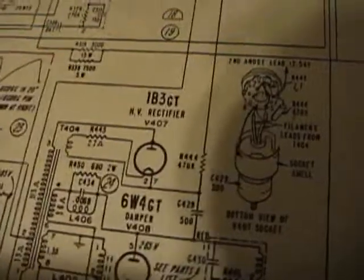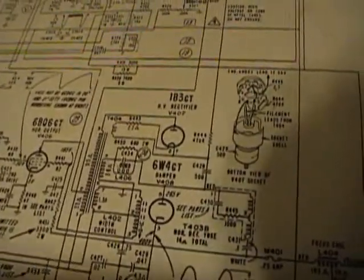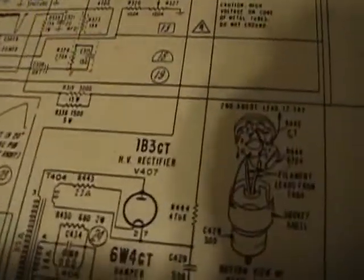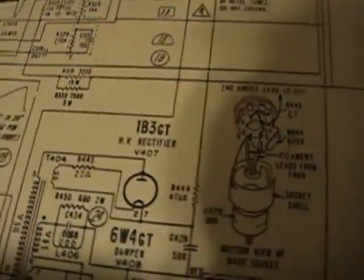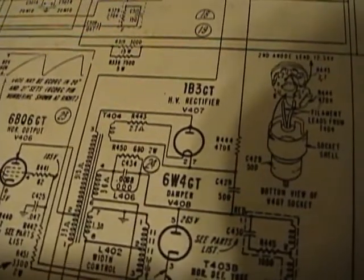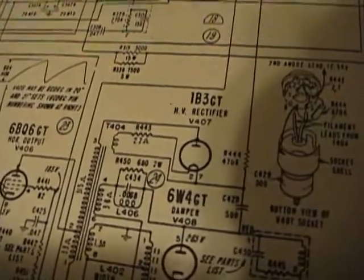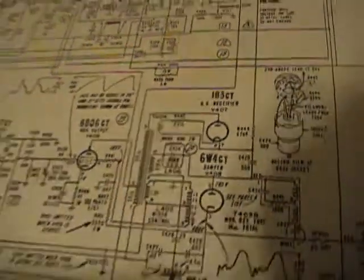Well, I found an article on the Antique Radio Forum. Somebody had exactly the same problem, and they also found the schematic. And what he did is he took an inductor he happened to have lying around and then fiddled around with different capacitor values to reduce that ripple. I take a little bit more of a scientific approach though.